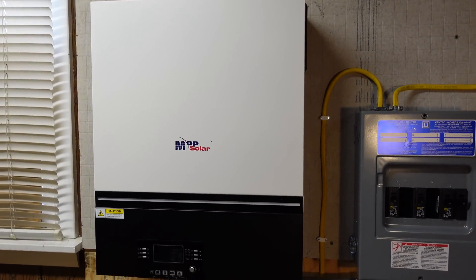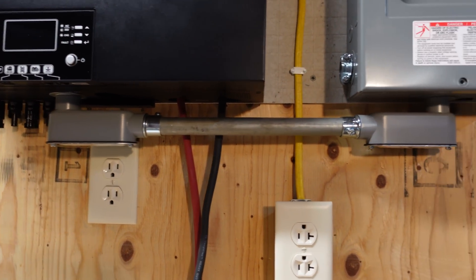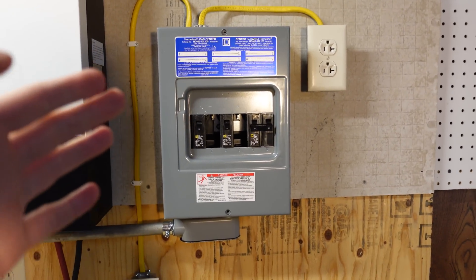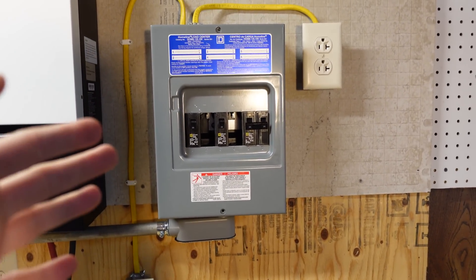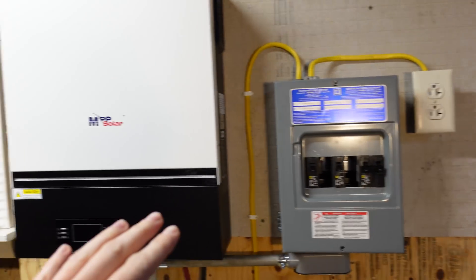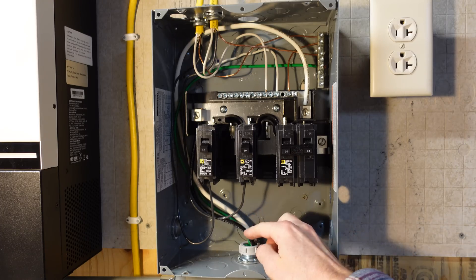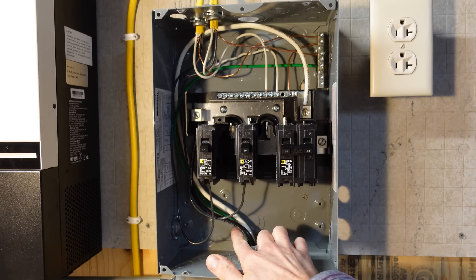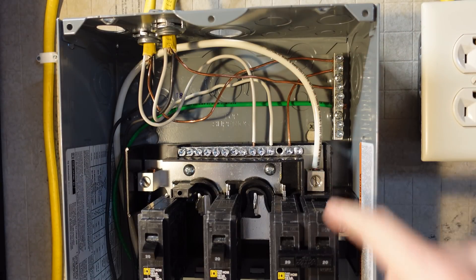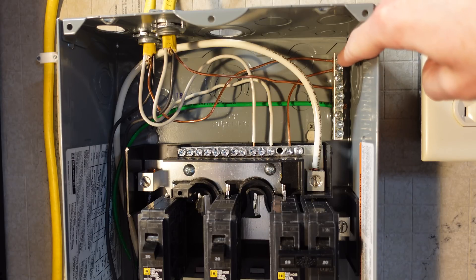I've got my inverter set up here and you can see on the bottom there is a piece of EMT conduit that comes out and goes over to what I think is a 100 amp panel. For the purposes of this video, this is the main system panel — not a sub-panel — because there is no AC input connected; this is an off-grid inverter. My cabling comes in here as THHN: a black for the line, a white for the neutral, and a green for the ground. The white goes into the neutral bar, the black goes into the first bar on the left, and I have a smaller ground bar at the top where all of the grounds land.